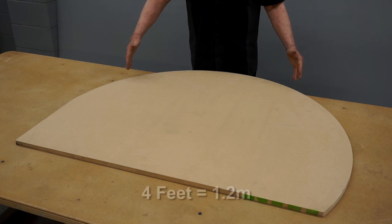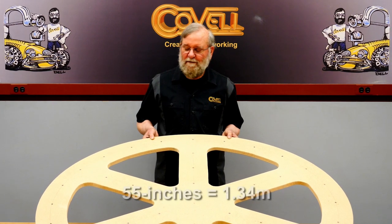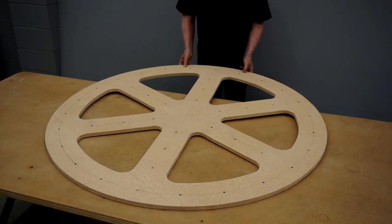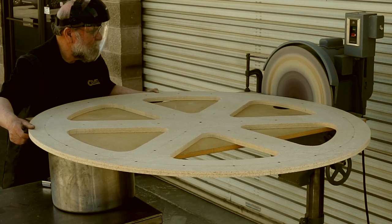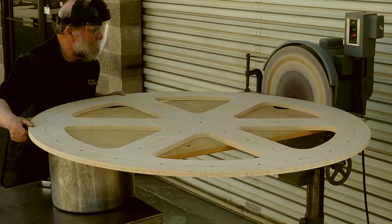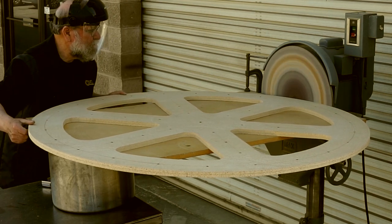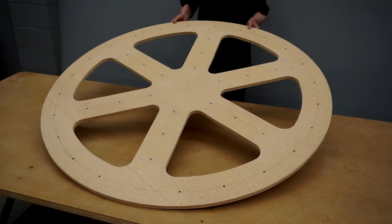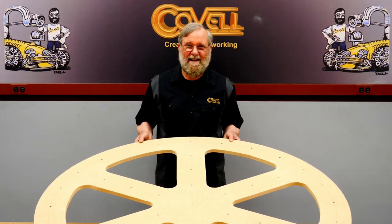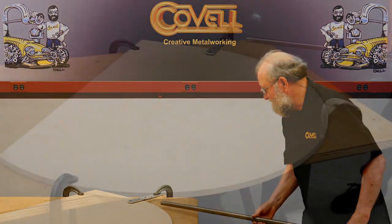Since my channels are only 4 feet long, this form doesn't need to be a full circle. I made another form with a 55-inch diameter to fit the curved channels against for the final assembly. I made both these fixtures by rotating the blanks around a pin while holding the edge against a disc sander. This ensured that I have a uniform radius. I cut holes in this fixture to reduce the weight to make it easier to handle. Now I can bend each one of the channels around the form.